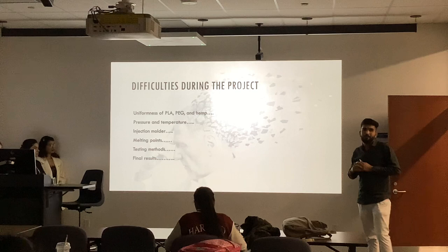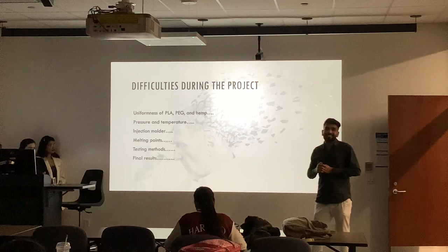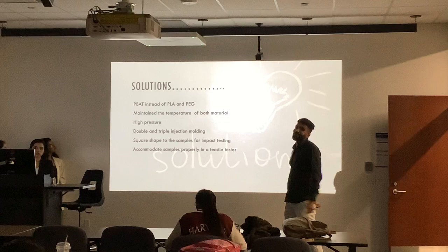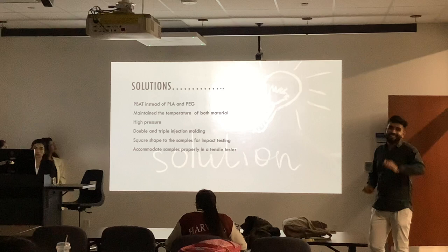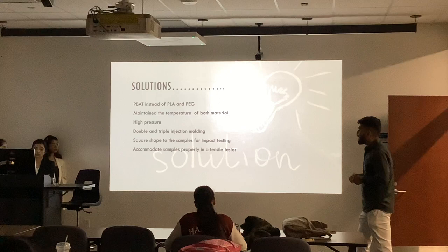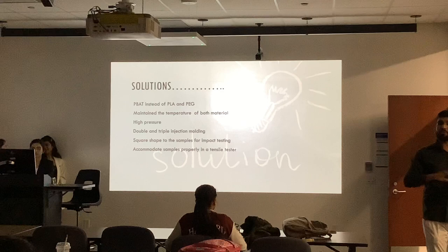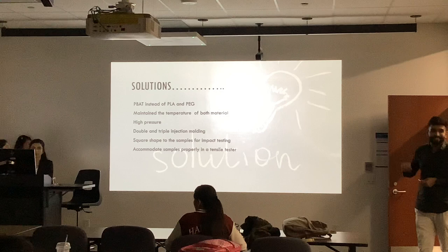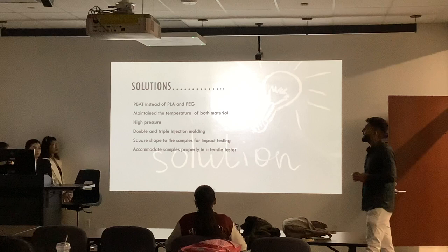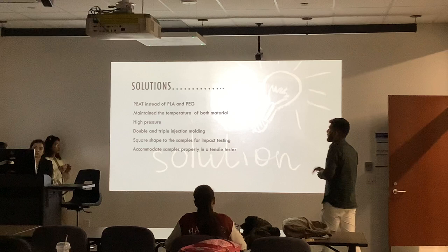The final results were not what we expected from the data and scientific papers we had read. Before talking about the solution, I would like to thank my whole team because they tried very hard. I would like to thank Margaret Carter, who suggested we go with PBAT instead of PLA, and Blasi, who helped us during the initial stage. As one famous footballer said, I have never scored a goal without a pass from my team member — each and everyone here played a very good role. The solution: we came with PBAT instead of PLA and PEG. We used PEG as a plasticizer because PLA is too brittle, but if you go with PBAT, you don't need PEG because PBAT is not that brittle.